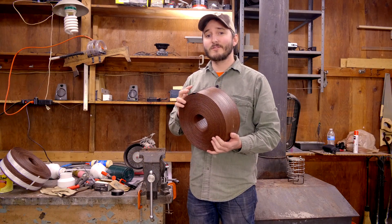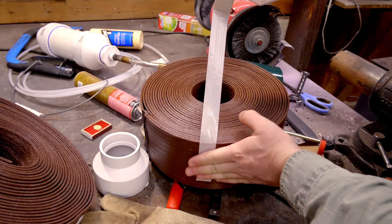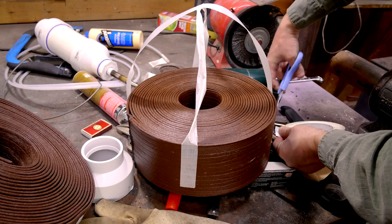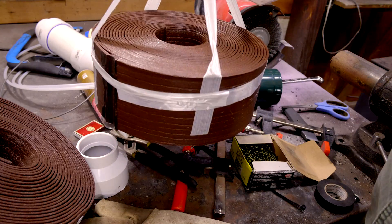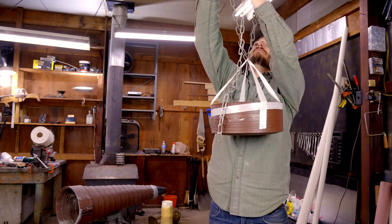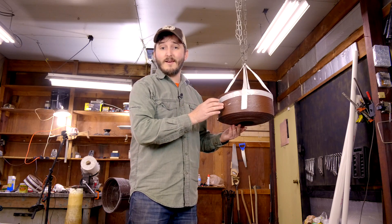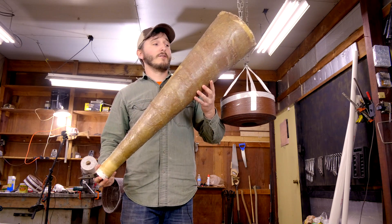Now that this has been welded, I still need to use a little bit of fiberglass reinforced tape so that we can suspend this roll in the air, holding it by the outside layer of the roll, and I'll use fiberglass tape to create straps for that. Now that this roll of plastic is suspended in the air held by the outside layer with our tape, we can begin to form our cone by pressing the center layers of this coil downward. Depending how far we push these layers down, we can make a very long narrow cone, or a short stubby wide angle cone.